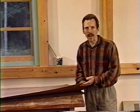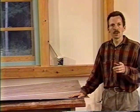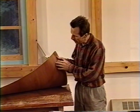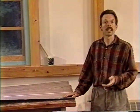First, you get to pre-press this veneer in the flat before putting it on the curved panel. In this way, you can examine the Two-Ply and make sure it has been successfully pressed. If you find an area that didn't press properly, you can go around the back side, make a small slice, inject some glue, and repress that area. Even if the whole pressing on the Two-Ply was a failure, at least you don't have to throw away the entire panel as well as the Two-Ply.